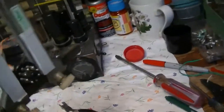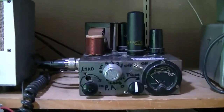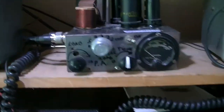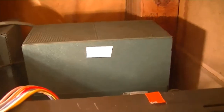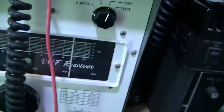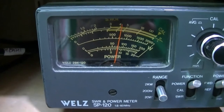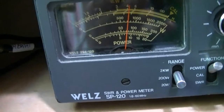Here's the transmitter setup with the coax adapters plugged in, hooked up to the modified Heathkit power supply — about 300 volts on the plates under load. We've got the keying relay set up to key a relay box which keys the SB-200. Without the amplifier we were getting about 7 watts.